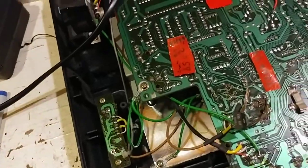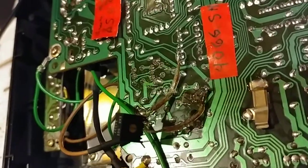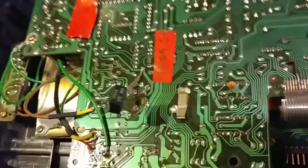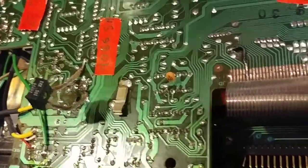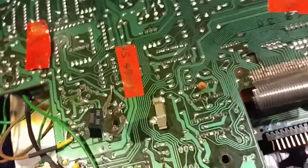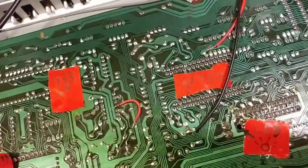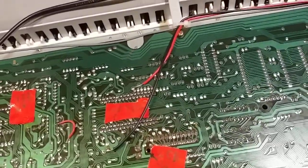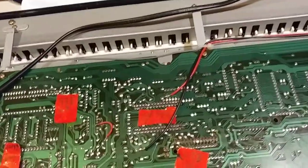So I'm jumpering it with another 500 ohm trimmer. I'm going to put it back in the circuit so you can hear what it sounds like. The trimmer is in the circuit now, set to about the midpoint — about 240 ohms. Now let's give a listen. We still have the pulsing, so maybe it's supposed to sound like that. But here's polyphony — now we're sounding right.